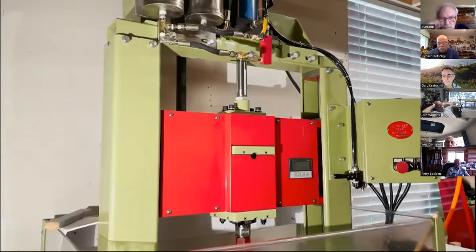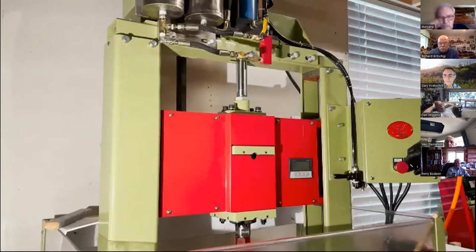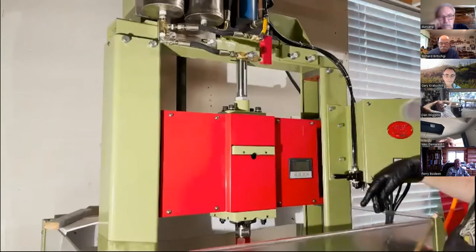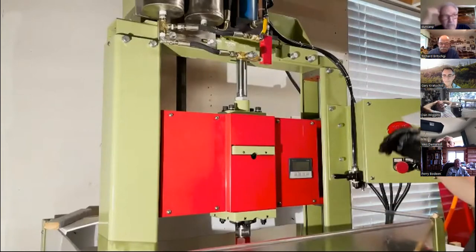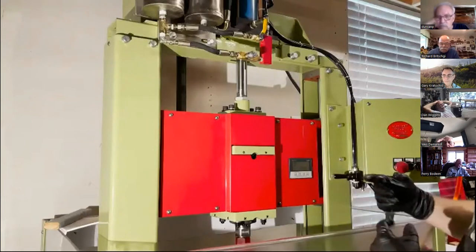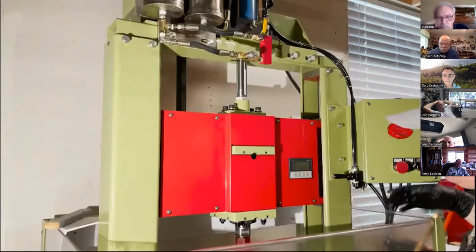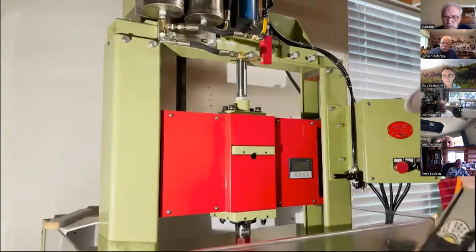Turn on our master switch, safety gear on. Start up our pump. Our pump is circulating oil from the base up through the drill bit itself. We also have an auxiliary secondary oil that sprays on the outside of where you're cutting. That goes back down through a hole and recirculates. It also has an Everclean on the side. That's essential. The amount of grit that this generates is astronomical compared to a saw. It's got to be at least 4 to 5 times the amount.